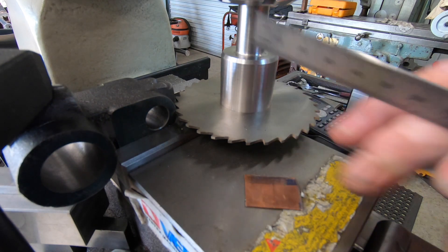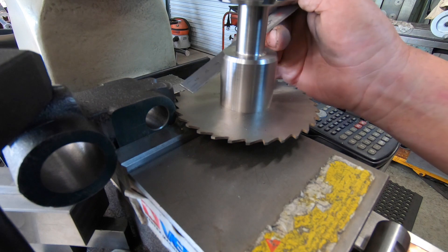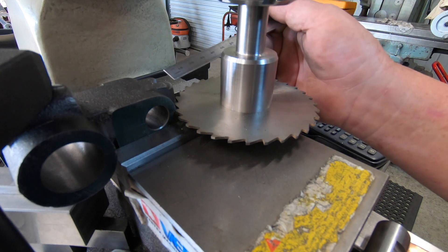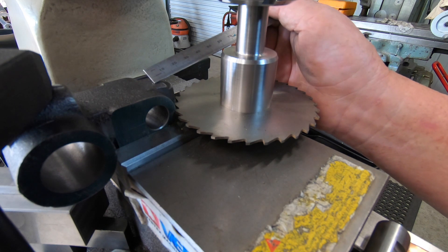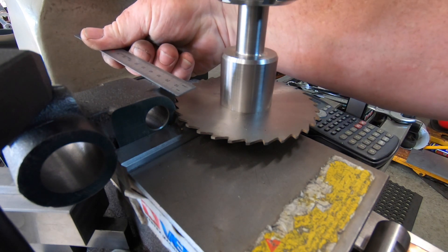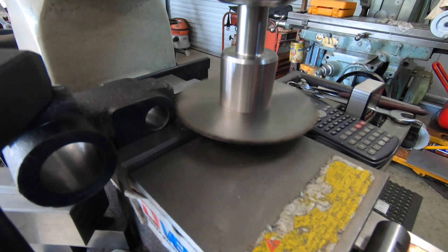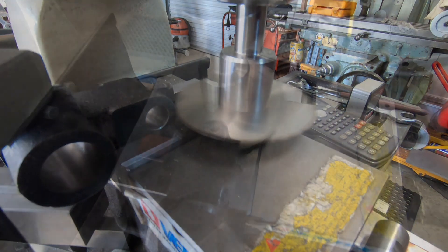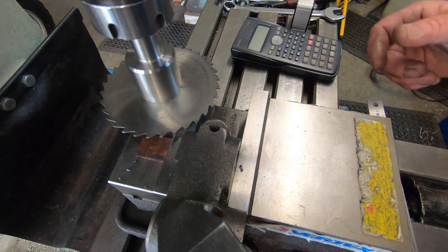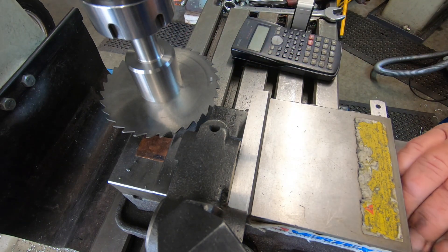This saw doesn't run very concentric. I've flipped the part over, realigned it, got the blade on centre — but the blade isn't very concentric at all, even though it's a nice fit on the arbor. I've flipped it over so the next operation I can skin the top of this off where the head of the locking bolt sits up against. Toby came in just after I started cutting that so I turned the camera off to talk to him. He's gone home from school and I forgot to turn the camera back on — I apologise.